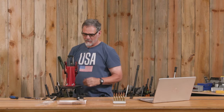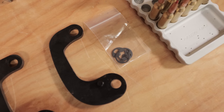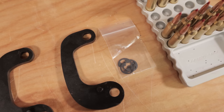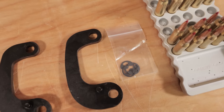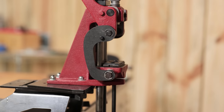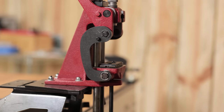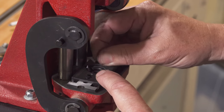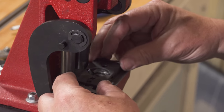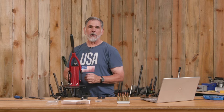We got her done in just a few minutes. The kit comes with four brand new E-clips; I went ahead and reused the originals because after you've taken them off and on a couple of times, they actually get easier to use. The big advantage to these curved linkage plates is, of course, this improved access to your workspace up here, which is real handy because the Forster has these jaws down here that do need to occasionally be removed, replaced, changed out, or just serviced. So it makes it easy to do that — you can get your hands in there without banging up your knuckles.